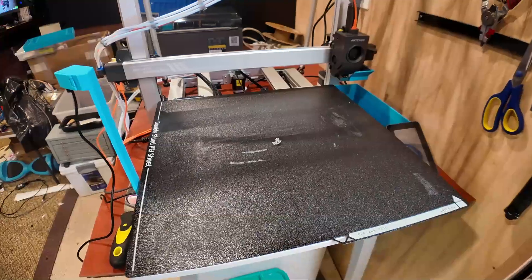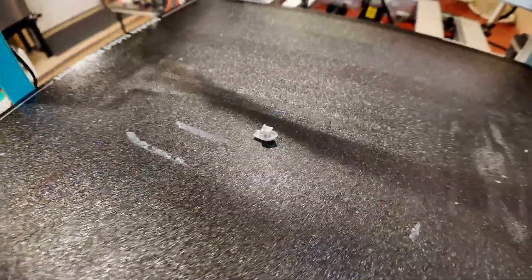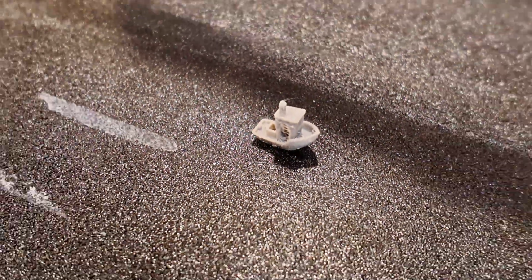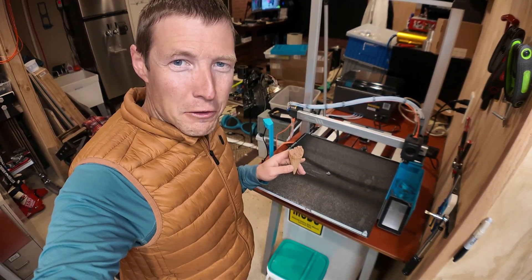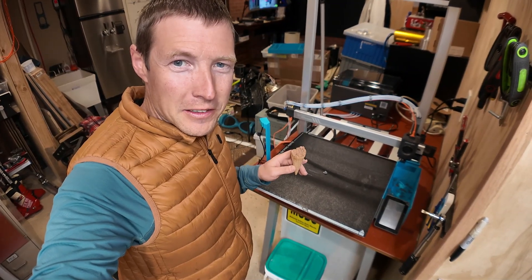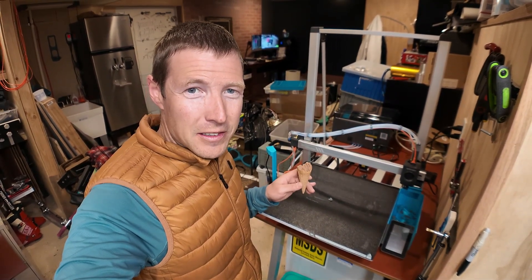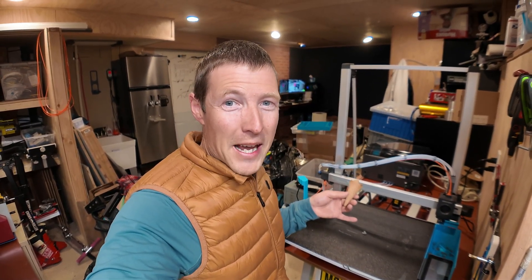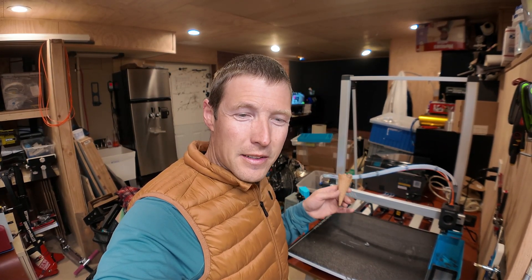This is how small a 25% Benchy is on this printer — so tiny. I'm pretty blown away with how tiny it printed a good Benchy. I did a 0.05 millimeter layer height with my 0.2 millimeter nozzle, and I think this is a pretty good test to show it has all the capability needed for much smaller, higher definition prints. That's a success for testing out the 0.2 millimeter nozzle I made. Check out my other videos to see how to drill out larger nozzles, please subscribe, and I'll see you guys next time. Thanks.